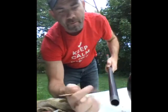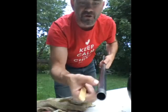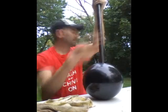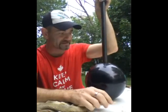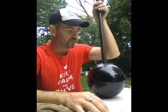What I did was I used a steel grinder and actually cut into the smooth surface of the pipe end, putting a bunch of slice marks with the grinder right in it. This gives the epoxy something to grip so it holds up really well. Make sure that hole is wide enough to fit that pipe all the way down. What I use is a rubber mallet — I hammer the pipe down and in. Once it's in and the epoxy is applied, you can smooth it out, but know that as soon as it hardens you won't be able to chip it away. Let it cure for about 24 hours and then you're ready to go.